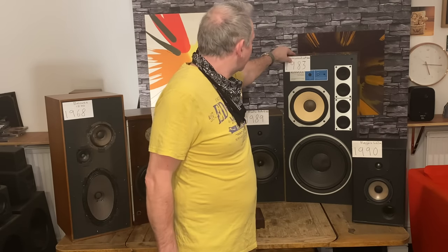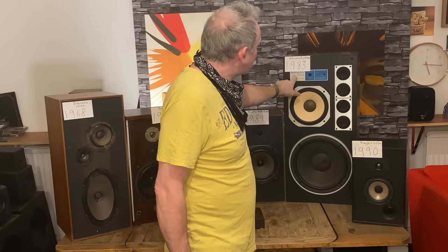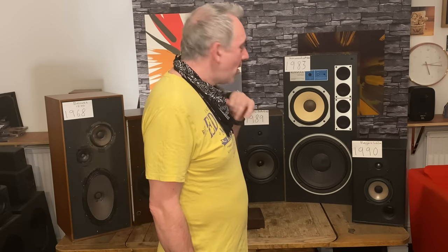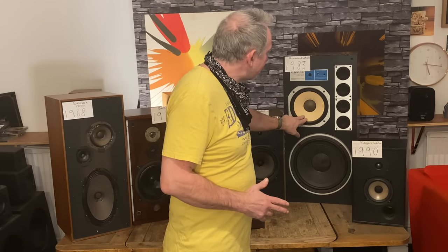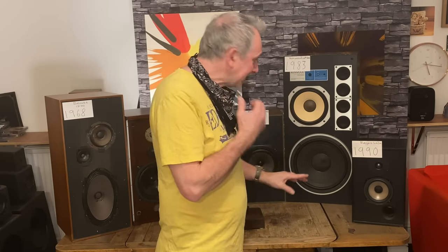This Kenwood LSP-5000 — it says 'two-way speaker system' but my brain was going 'that's three-way' — bass driver, mid-range, tweeters. I unscrewed this bass driver to discover it's not a bass driver at all: no magnet, no wires. That is an auxiliary bass radiator. It vibrates in sympathy with the woofer — when the woofer is doing bass, this augments the low bass by vibrating in sympathy. It's not powered.